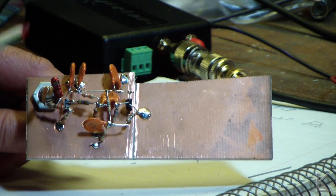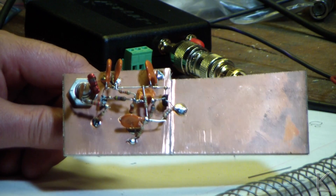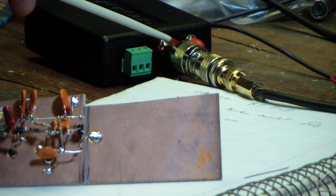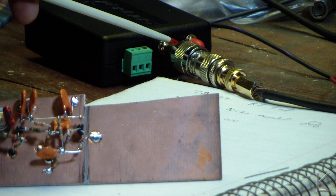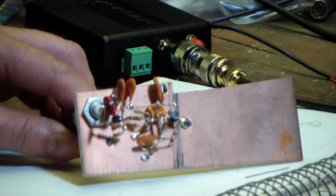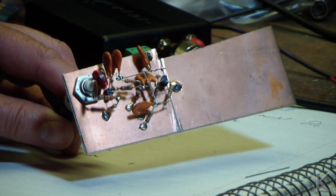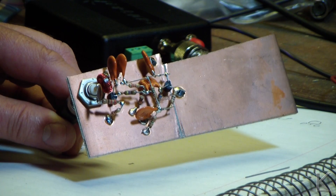Now this is powered by DC on the cable, so you would normally have a decoupled DC power source of nine to twelve volts driving this. What I am doing is trying to use the second RF port of the SDR play - they have an output of bias voltage that you can switch on. It's only about five volts, four point seven or four point eight, that's going to come up the coax to drive this, so the gain on this amplifier is probably not what it would be with a 12 volt source.